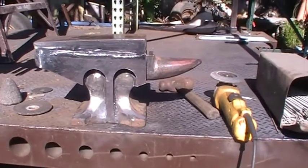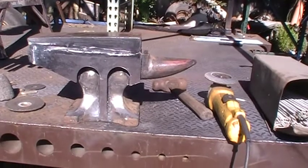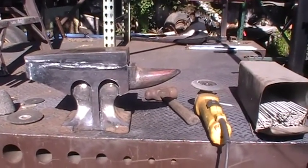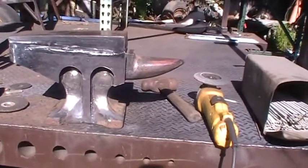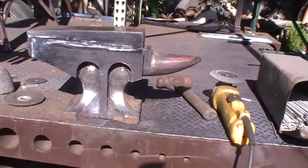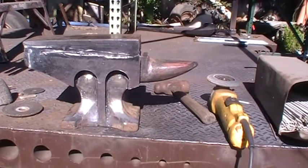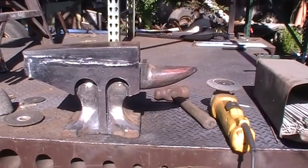What I decided was I'd take this forklift fork, cut it down to the length — which is about 11 and a half to 11 and three-quarters inches — and just leave the same running width. They've got those church window anvils and I thought they looked so cool — an old armorer's style. So I had some five-eighths plate, hole-sawed it out. A lot of work hole-sawing five-eighths plate, but I got them out. So this is going to be a fake church window anvil.